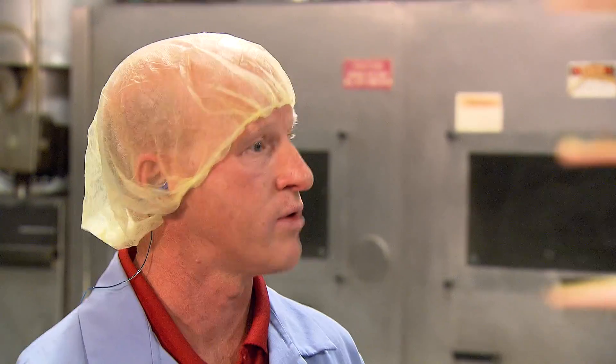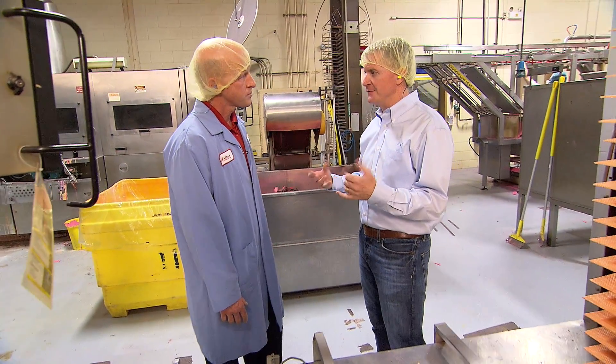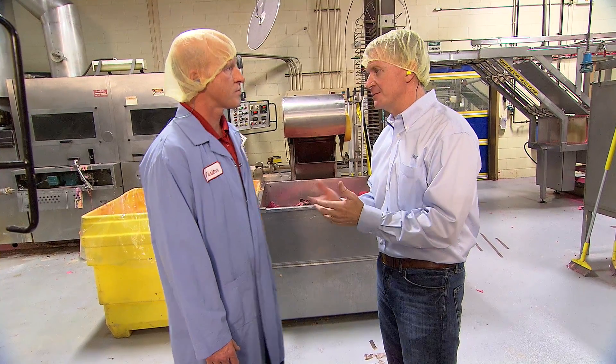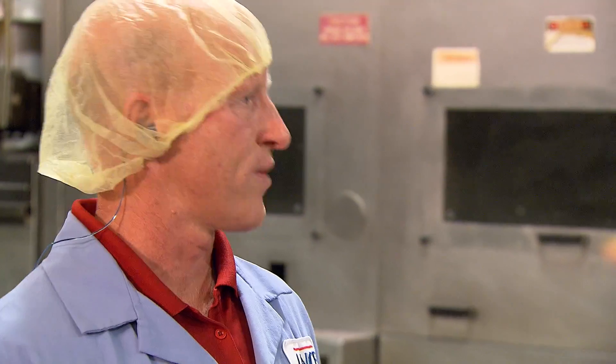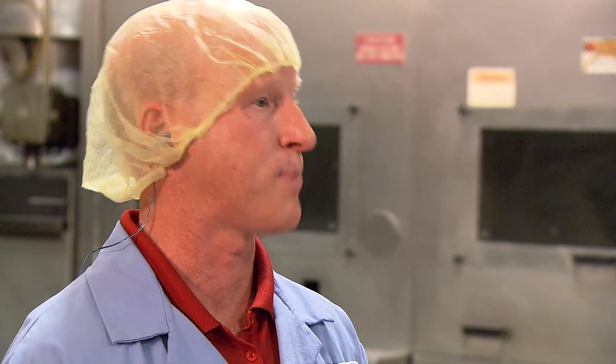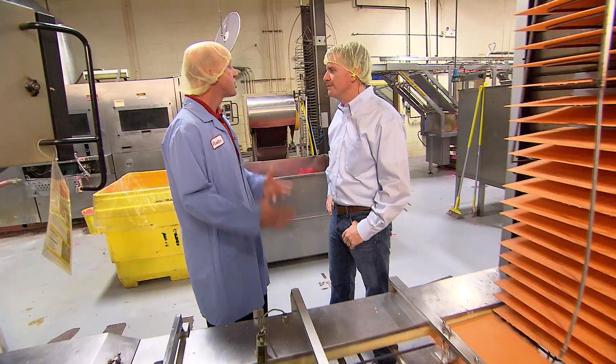I know they're excited, we're excited, and we're just looking for more opportunities to help them with some of their issues and maintenance problems. It seems like there are a lot of things SKF is helping with beyond just this oven unit. The perfect example is they look after lubrication systems. They also make a lot of specialty seals — there's a lot of flow with their icings and that. There's another program they're going to put in place where they can look at critical equipment, do vibration analysis, and schedule their downtime instead of having catastrophic failures where you're losing product.